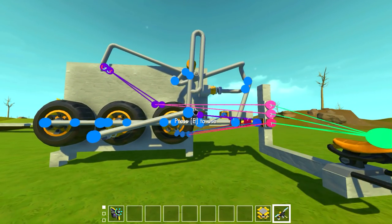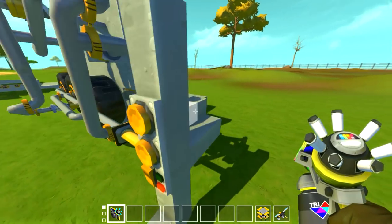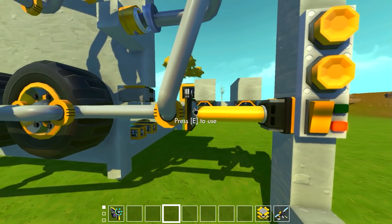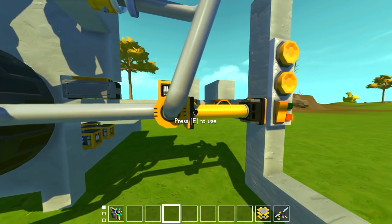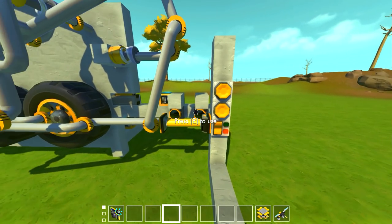It might look a little complicated. It kind of is, I guess, but it's not really terribly difficult. The two sensors here are really just to sense the piston positions to move it in and out. So when the piston's fully extended, that sensor will just reset a memory bit in the back. And when the piston's retracted, it will come this way.